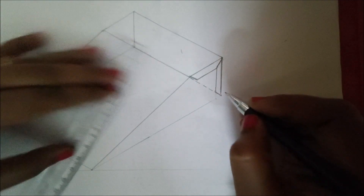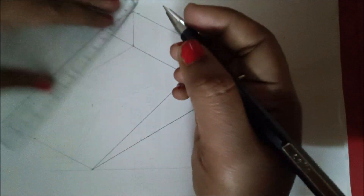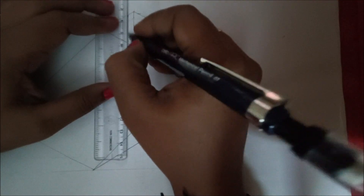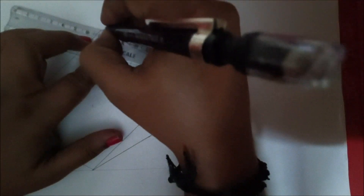The remaining portion should be darker. Similarly, you are going to do the same on the other side — make a distance of 5 mm here and 5 mm here. Parallel to this line, draw a line lightly. Here also draw a line, but since it is not visible, draw it with dotted lines — for each and every hidden line it should be in dotted lines. It is up to this point, and rub the unwanted lines drawn lightly while making other lines darker.